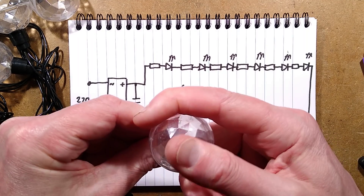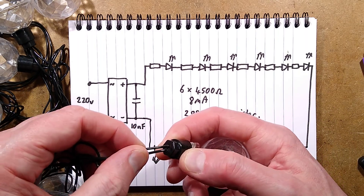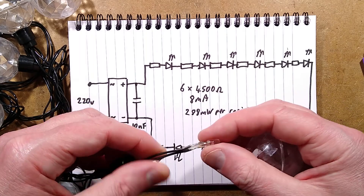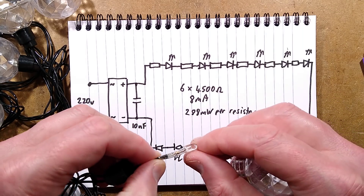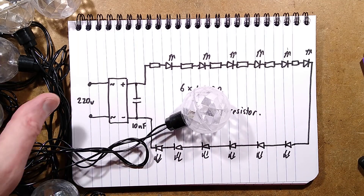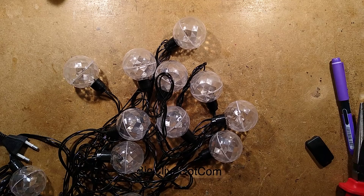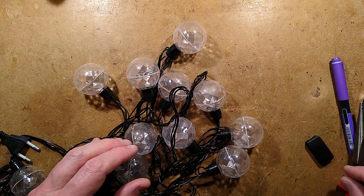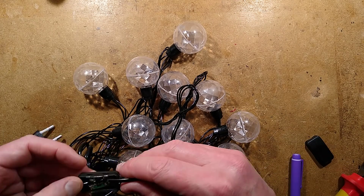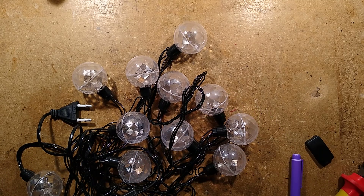I got them for the covers. The covers are not as clear as they could be, but other than that it's quite a nice little cap. They've put the wires through and terminated them into the sleeve so it can't come back out again. Usual arrangement - big blob of solder on the side of that resistor. But they were worth getting to take a look at. They're not particularly inspiring, but as you saw at the beginning they do kind of look okay - a nice sort of visual effect. Very typical of the sort of lights you get from China: little strings with a small number of caps. Some do have a bit more circuitry with a capacitive dropper, but a lot of them just seem to work on a bridge rectifier with resistors in series with LEDs.